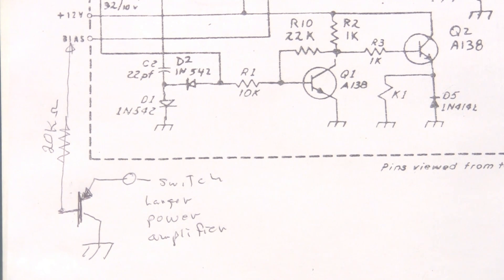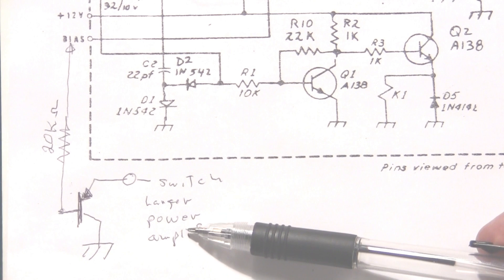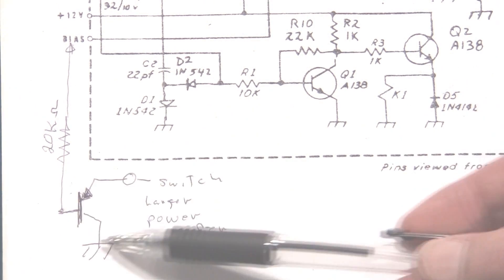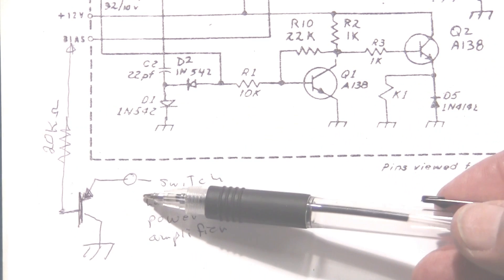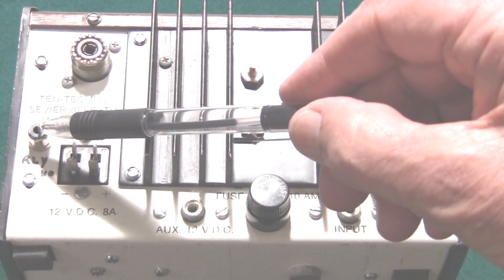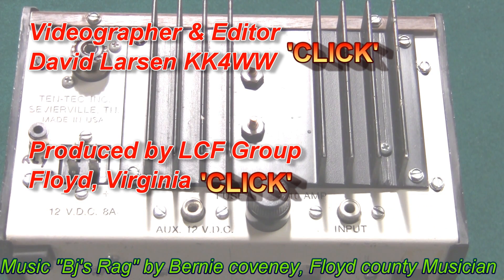Here's a bonus circuit — when the transmitter is switched on, this line goes to 12 volts, and I've added circuitry to switch on a larger power amplifier. What I've done is used QRP into the 50 watts, and then the 50 watts into a kilowatt, using a transistor to switch the higher power amplifier. I have two of these amplifiers. I'll show you the back of the one with that circuitry, which I use at home sometimes with our one-kilowatt amplifier. I've also used this in one of my videos on the Russian QRP, running the Russian QRP into this amplifier at 50 watts.